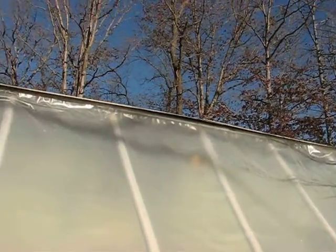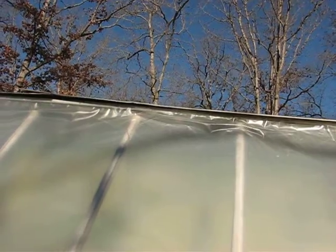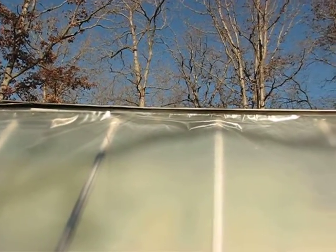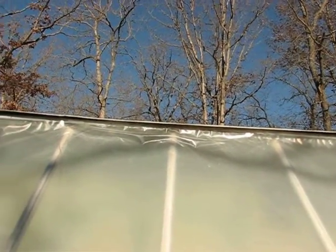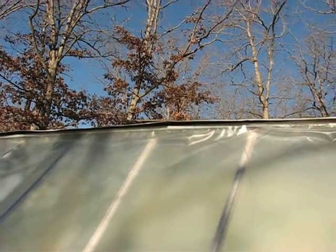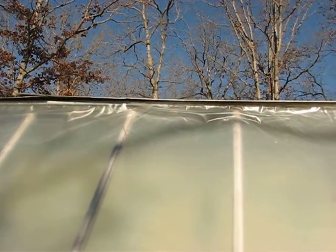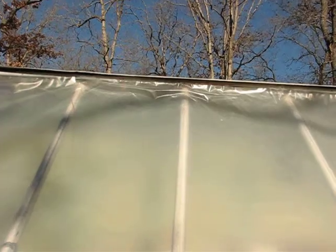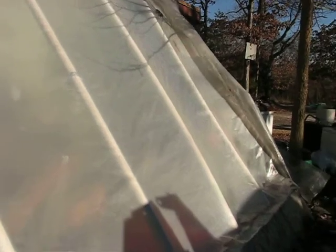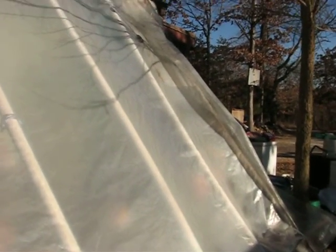We put it around — I think that's one inch around there — and then screwed that in under the eaves. I put in some of that metal there, and you can see where it's sticking up a little bit. I put that in to keep the rain off a little bit more, because when the rain's blowing from the south it'll blow in under it and leak down inside. I need to do something else on that still — going to be a drip or two here, but not bad. I think that's it on the outside.